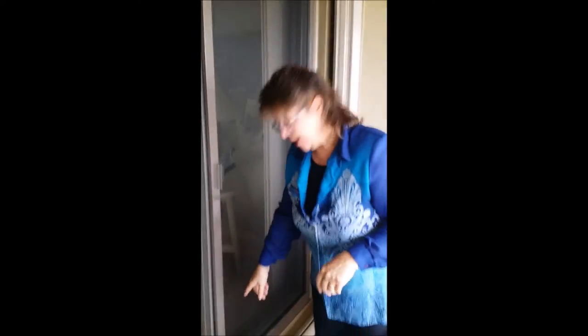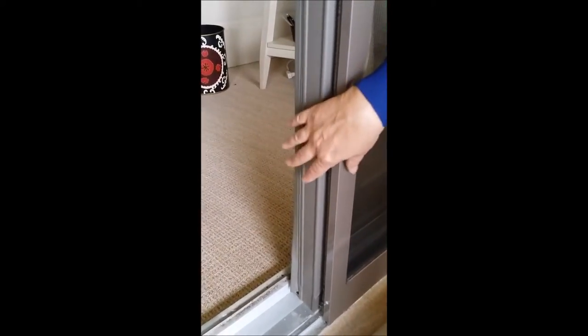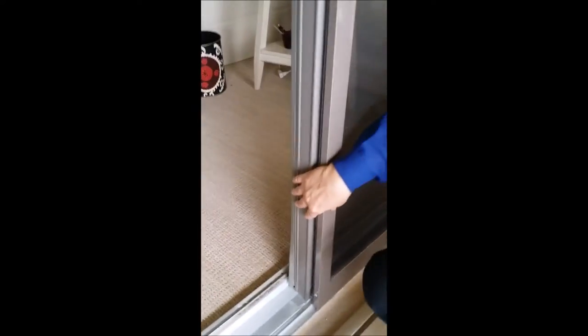Now, another thing that sometimes happens in the Andersen doors is when the wood swells up and gets a lot of water, it will have a tendency to rot. And that will happen down at the bottom most commonly. On this first door behind the screen, this particular door has a little bit of that. But because this location is rather shaded, because it has a nice porch, this door doesn't have as much rot as if it got a lot of water.